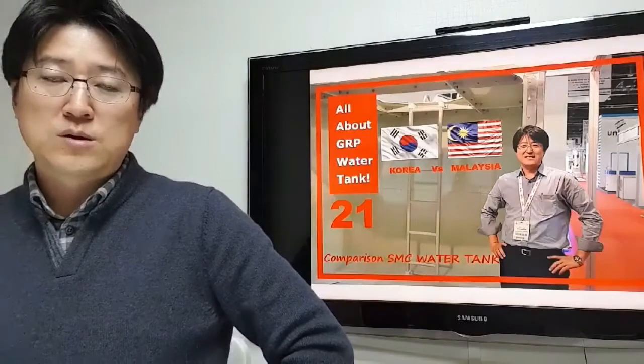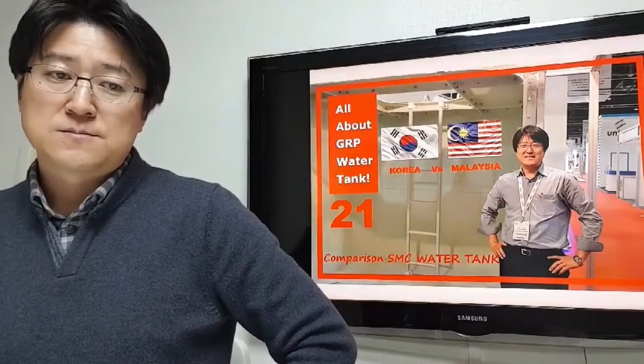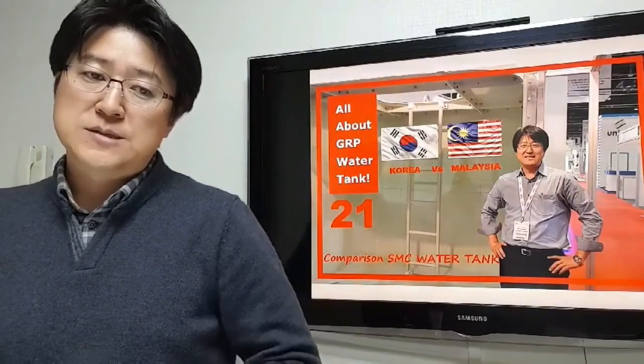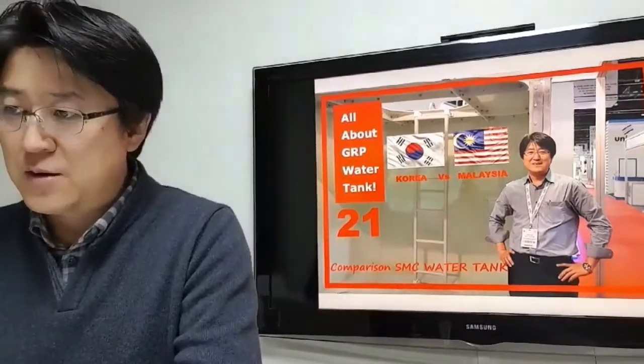They import raw material from China and Korea to make panels. The reinforcement system was influenced by Japan and the United Kingdom. The panel flange is 90 degrees and the tie rod is passed through the panel like the Japanese style and finished outside. We will see the following photos.